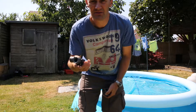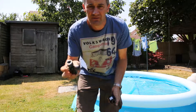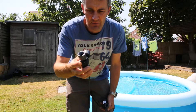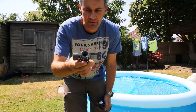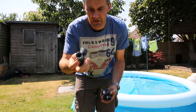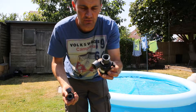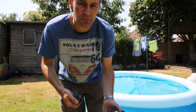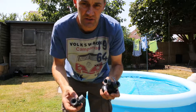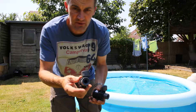I'd like to do a comparison of two solar water pumps — they're both 24 volt pumps. This is a standard fairly cheap 24 volt pump; it's only about five or six meters of head so it doesn't actually push the water through with that much pressure. This is a slightly more powerful solar water pump that we normally supply with our total solar pool heaters, and this has got an eight meter head. I'm just going to dip them both into the water and we'll see how much water flow we can get out of them.